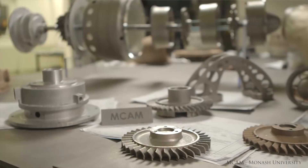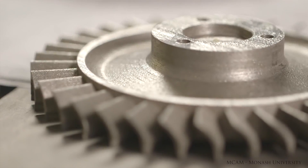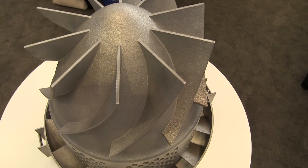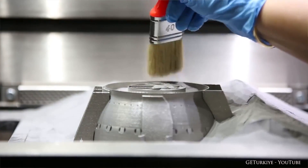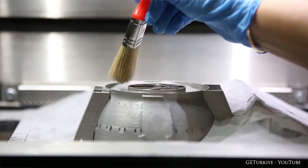In terms of surface finish, historically with very large 3D printed parts you give something away in surface finish, but this surface is actually very uniform all the way across. Are we looking at finer and finer surface finishes in the future? Yes — the melt pool process, the material itself, the different granule sizes, and the amount of power put into the build layers will all change the resolution and surface finish.